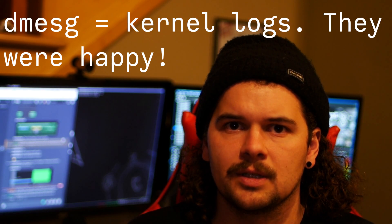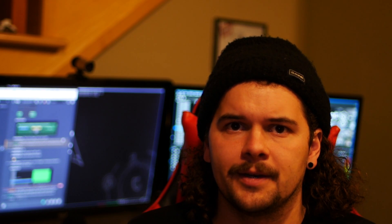So we have a fully assembled device. When you connect it to the computer, it enumerates, and you can see it come up via dmesg. So the USB controller I can see is working. It fits in the enclosure, and I can connect to the microcontroller. So as far as this revision goes, I'd say that it's a complete success. However, there are some issues.